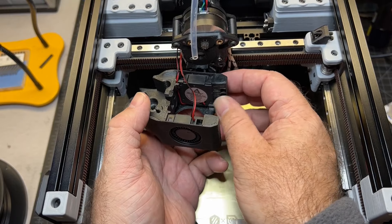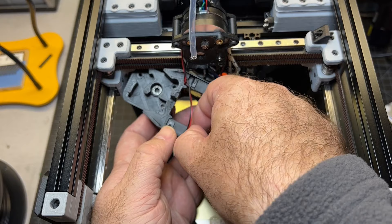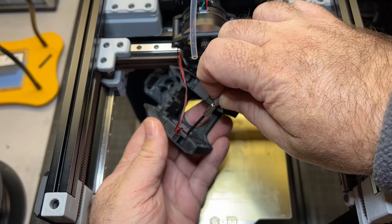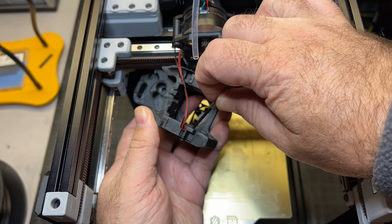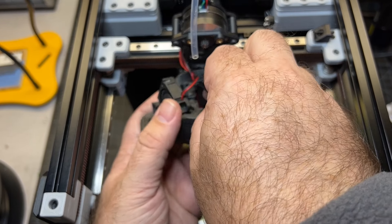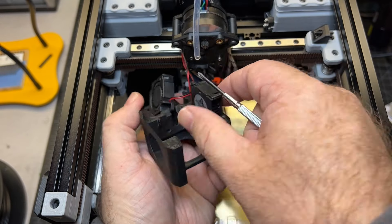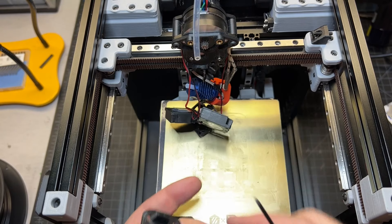I just popped out the front part cooling fan — just be really careful doing that. Remember it kind of angles in to come out. With these, there are little holes here and there's also a spot where you can use small pliers or a screw to kind of help move it, which makes it pretty easy just tapping into that hole. Don't push hard on the front because you can definitely break these little fan blades — and you don't want to do that because they're ruined.